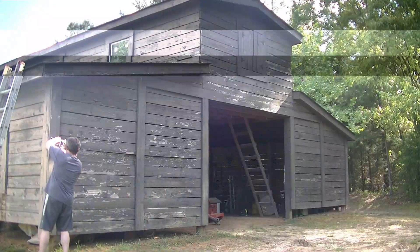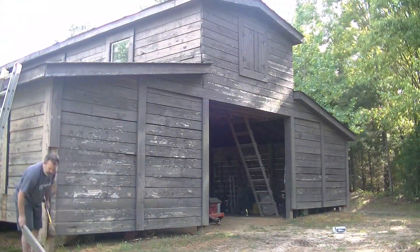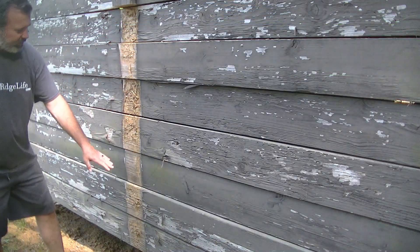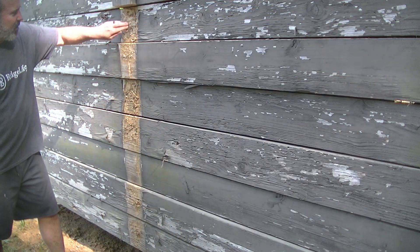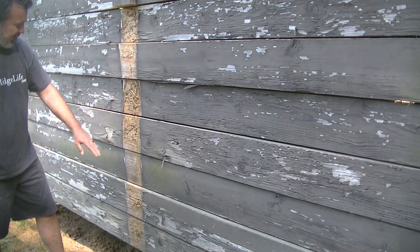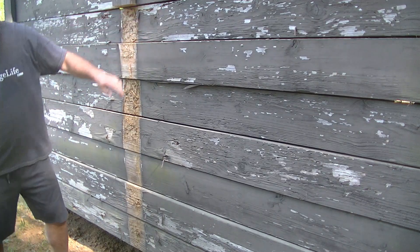The north side of the barn is kind of weird. The termites moved up the verticals and went out some of the horizontals, like three or four up. So I've taken off the bottom one already, and I'm going to have to take off random horizontal ones to get those totally rotten boards out of there. The verticals were actually in really solid condition here, but you can see they ate horizontally in different spots — just crazy. They'd go up, go over, go up, go over. Really wild.